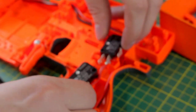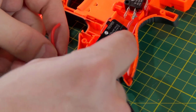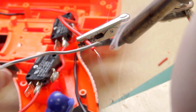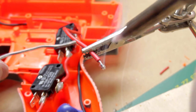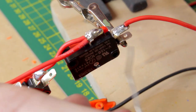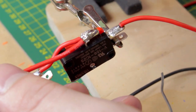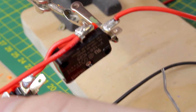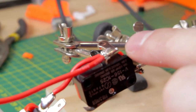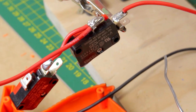So you can see now we put these in place. So the next thing we want to do, wire the flywheel positive to the common as well. So when you're soldering two things together, it's a little bit nerve-wracking because if you apply too much heat for too long, you'll melt the original solder holding the wire on. But if you just go slowly, carefully, you'll get to a point where you've completely melted the solder of your second wire around the first wire. It's quite a nice blob. Yeah. Worked out. It's almost as if I'd done this before.